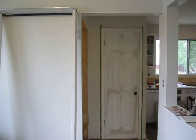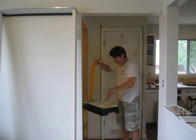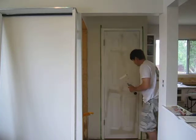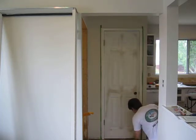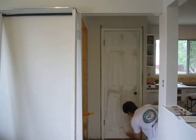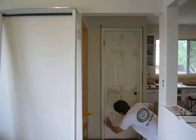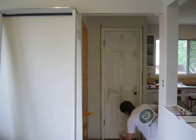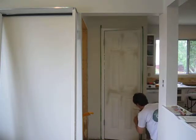Now for the rolling part. I'm using a three-inch Wooster roller — it's about a 5 mil finish. Start at the bottom. See that paint I just cut in is not tacking up at all — it's just rolling beautifully, which is quite the treat. It's not always the case with most paints, trust me on that.